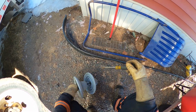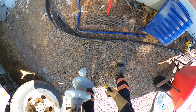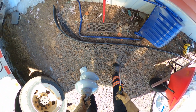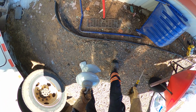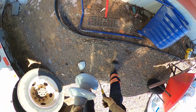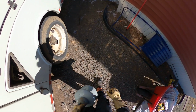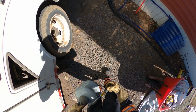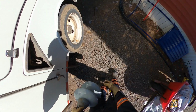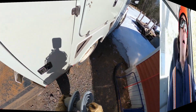I talked about the ring test before. When these are hanging off a structure, you can see I just lost it there now. But if you ring it with the hammerhead on your insulated stick, a good bell is going to ring. A cracked bell is not. During work permit, you're checking the bells right quick. You run a tool down the bells. You'll quickly figure out which ones are good and which ones aren't, if the cracks aren't quite as obvious as this guy. All right, so we're all good to go here.